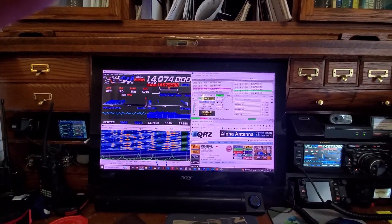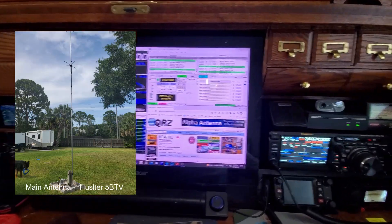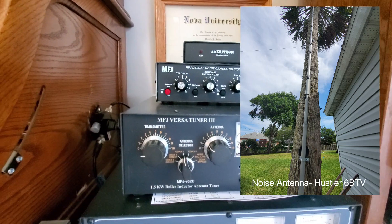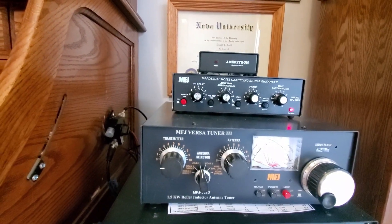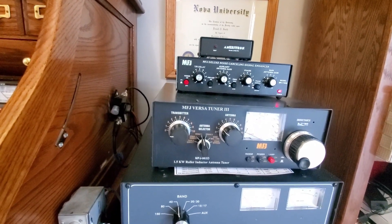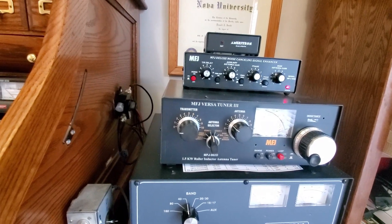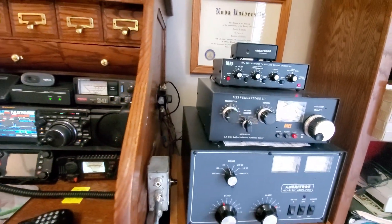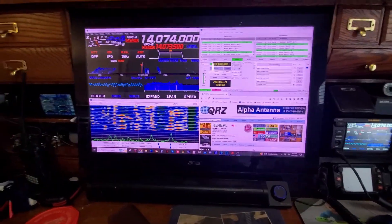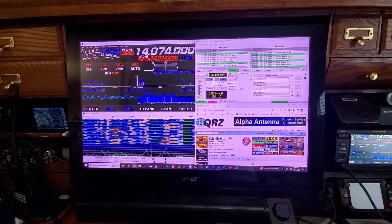The key to making this work is you've got to have a good noise sensing antenna. The 1026 takes two antenna inputs on the back. You get them where they're equivalent in amplitude, and then you basically invert one of them and that cancels the noise out. This works because the noise is nearby — it comes in at the same phase on both antennas. The signal you're interested in is coming in from long distances at varied phase angles due to reflections, so you do attenuate the antenna signal a little bit. Also, when I move around on the spectrum — tuning the radio or going to sideband — once I get over a couple hundred kilohertz, I have to retune the noise canceler.